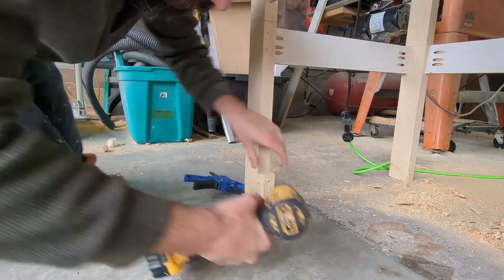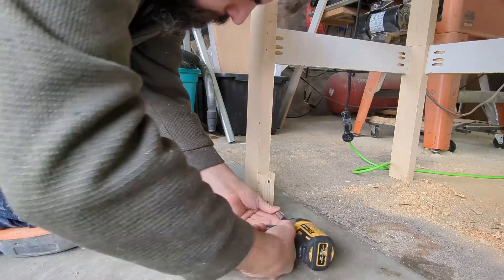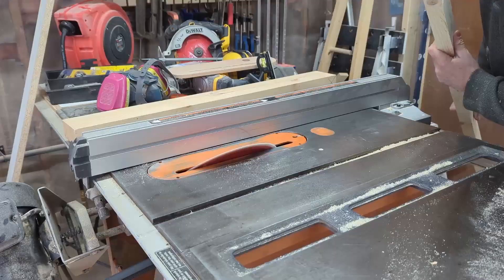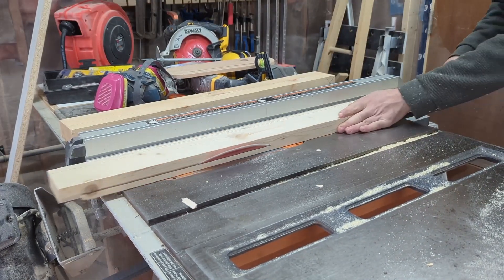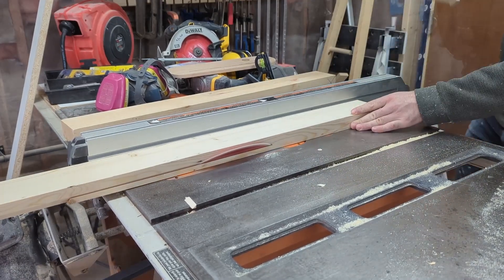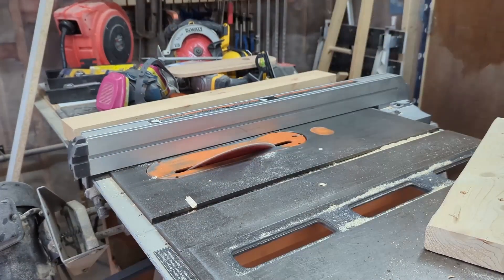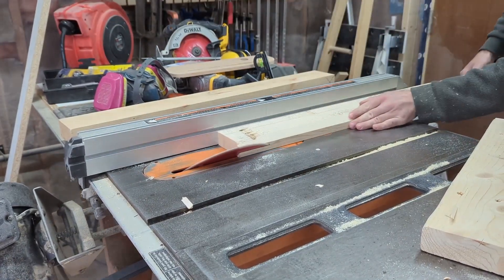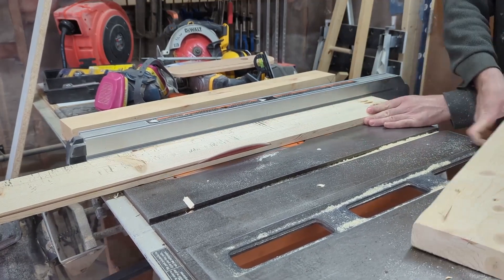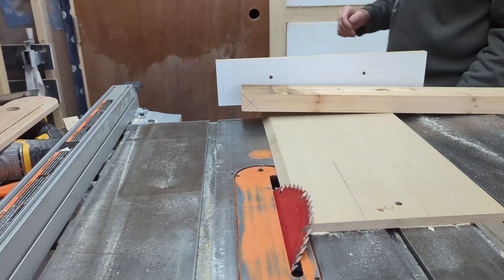Now let's work on a very simple and lightweight sliding dead man so that we could support some longer and wider work pieces. There are many videos on YouTube about a more traditional way to make these, but I'm just rigging something up for this light outfeed table. I've begun by removing my original lower stretcher and installing a couple spacers or support blocks at the bottom of the legs. I've cut a new stretcher out of solid wood that is the same thickness as my leg. With my table saw set at 45 degrees, I'm ripping this angle along both sides of my new stretcher and leaving just a bit of a flat spot on the top. You don't need it to come to a sharp point as this will just add more resistance later.